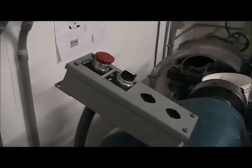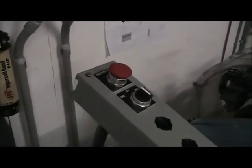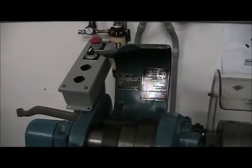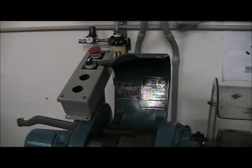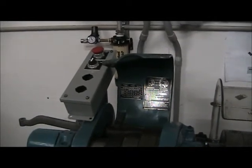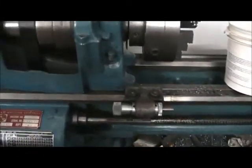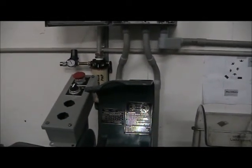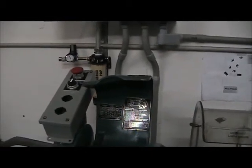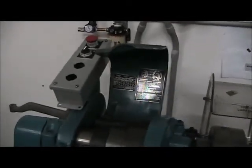This is an emergency stop on the top. I've got the forward and reverse knob there on top of that, and then down on the next one I'm going to have the potentiometer, which I'll show you in just a few minutes. I've chosen to mount this panel onto the factory mount. I've seen some folks will actually put a collet rack stand and mount that onto the ways, or take one of the old metal pole remote control knobs and mount all of it to that. You can do it either way you want to.